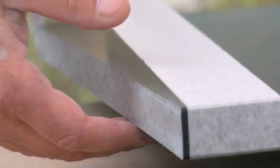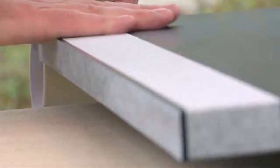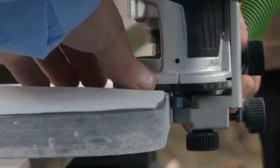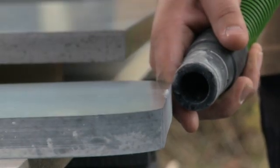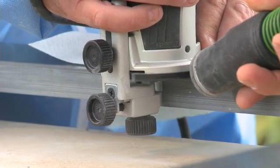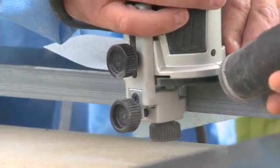Make sure the surface is protected using either 50mm masking tape or a section of thick paper roll. It's strongly recommended that a test cut is carried out on waste material to set the router to match the factory finish. The bevel should be carried out in 1 smooth pass, and some form of vacuum extraction is mandatory.